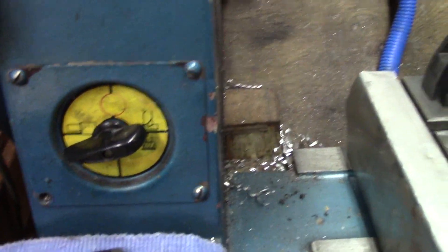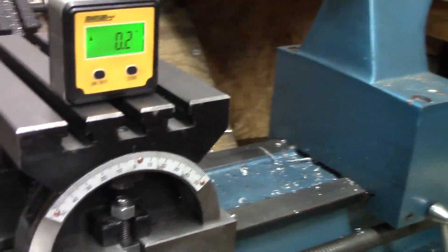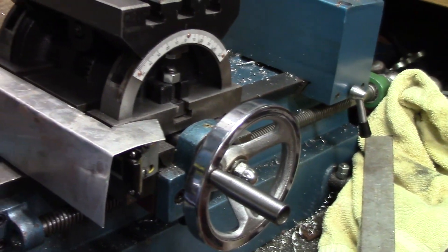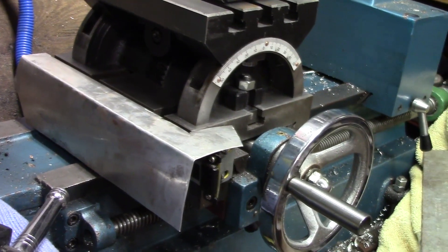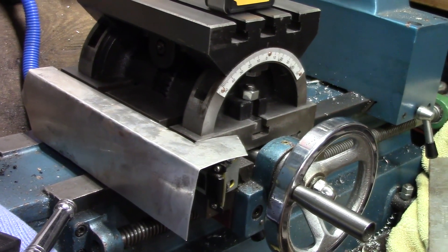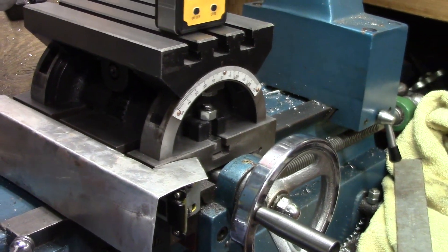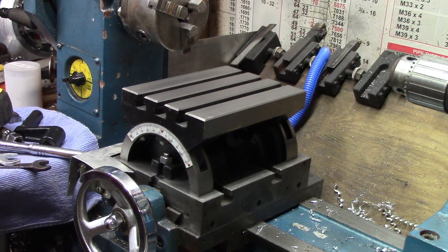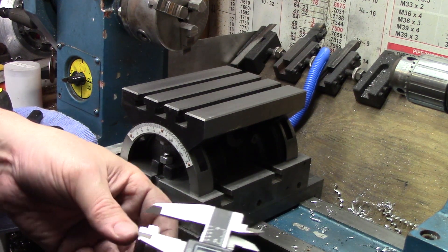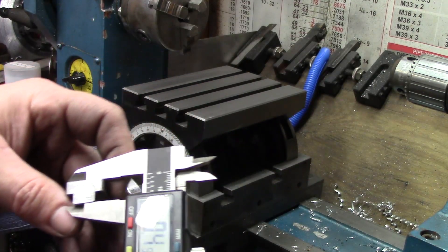I was kind of planning on this thing being able to do a 45 and didn't even consider that aspect of it. In my case it's probably not going to be a big deal to raise this by about an inch with some blocks — I should have enough head space. But on small mills, mini mills, that may not be good. We're already at three and a quarter inches tall as a riser, which on a lot of mini mills would already be a good riser size. Another inch is going to make a difference.